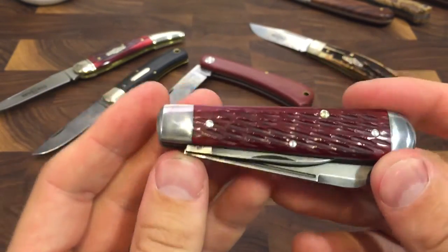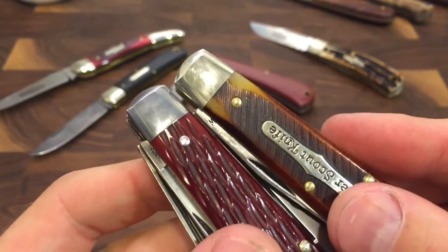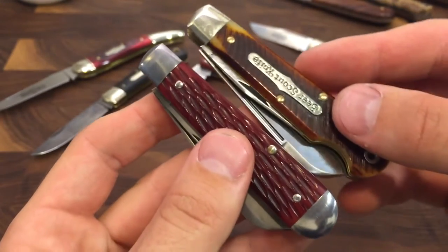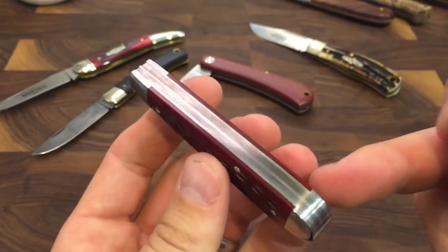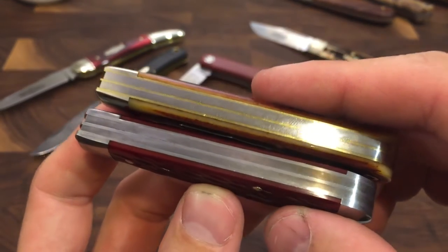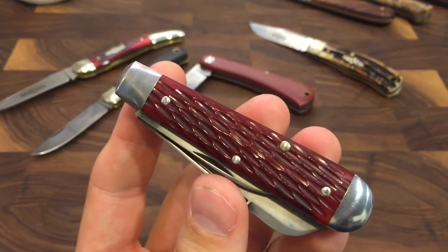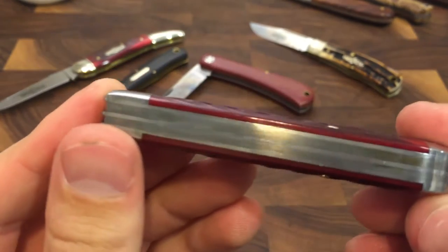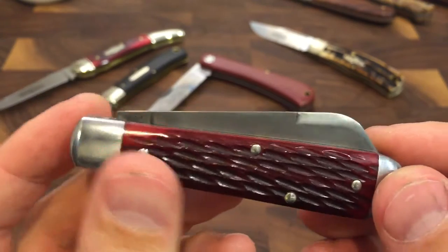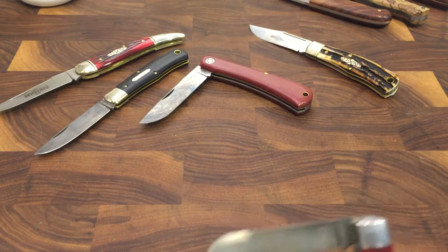Some people consider it cheating. The purest way to get a patina on your knife is just to use it — cut a few apples with it and it'll go quick because the acid does it to the blades. I read about this technique on bladeforums.com, which is probably the number one resource for information about these knives. Some of them have nickel silver bolsters. This bolster on top is nickel silver with a little bit of a yellow color compared to the one on the bottom, which is steel. Some knives are steel bolsters and steel liners; this one is nickel bolsters and brass liners. The brass will patina but in a different way, and the nickel won't. I kind of like knives that will patina all over.